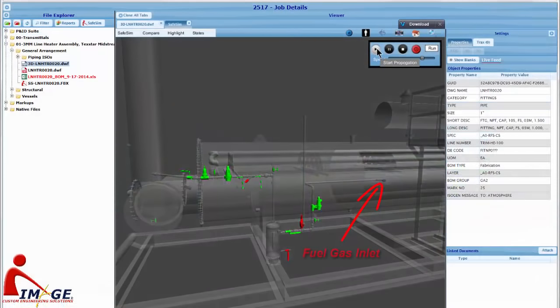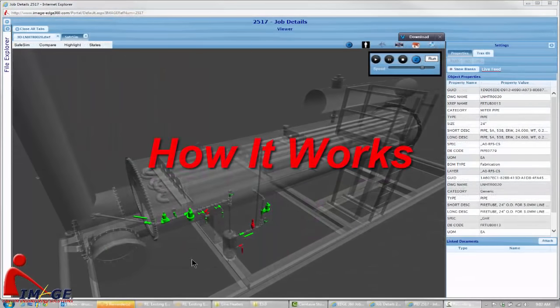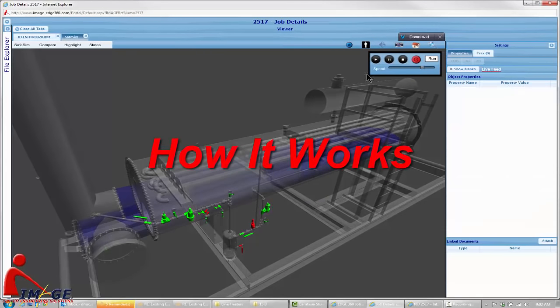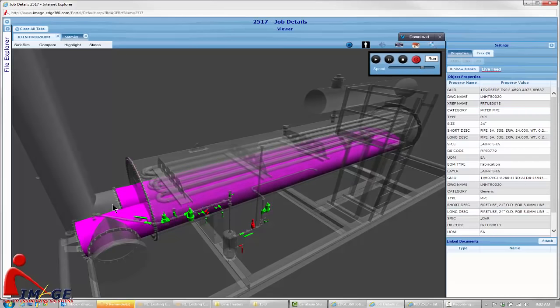The fuel train is essentially a system of pipe, valves, and instruments which take the gas from a high pressure source and reduces it down to just a few inches of water column at the point of injection into the fire tube where it is burned. Heat is generated from burning natural gas, often pulled off the well stream after the pressure reduction has occurred. Once this gas is released into the inlet of the fire tube where it is combined with the air, it is burned in a fashion similar to that of a natural gas-fired water heater in the home.